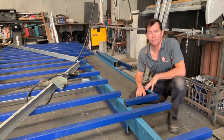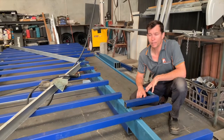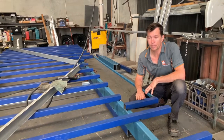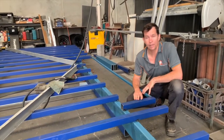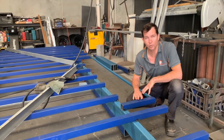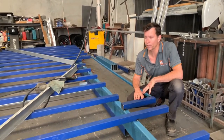Building the trailer, we then consider other things that we have to weld in place. That would be a small piece of tube within the floor to pick up on the internal cavity sliding door. On this particular job we have a small wood fire, so we'll put some steel members welded into the joists under the timber floor to make sure we get a good firm fitting, because obviously we don't want it to move while we're in transport.